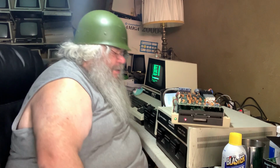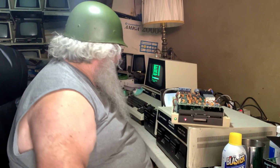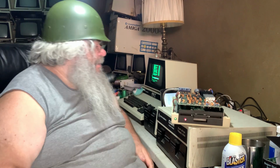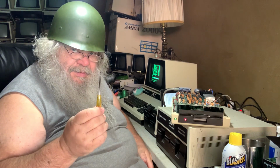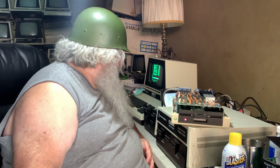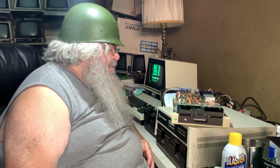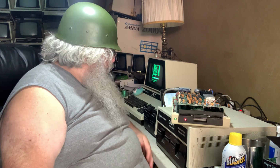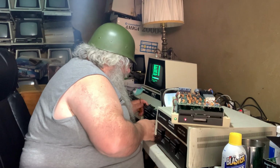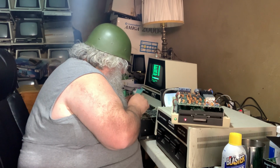And it will go out and hopefully format the disk. And once it has done that, then I think perhaps I will take my little wee screwdriver and one by one I will swap out the 6502 and the 6522s from the 2031, and I will put them in here. And actually, you know what? I'm going to be brave. I see one here.